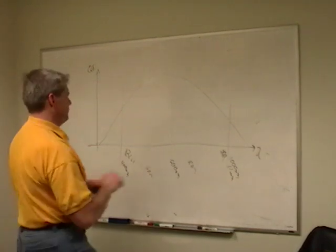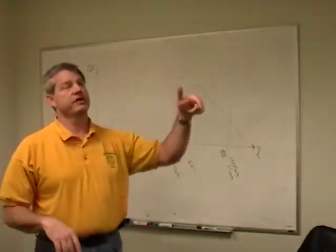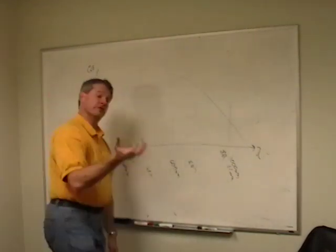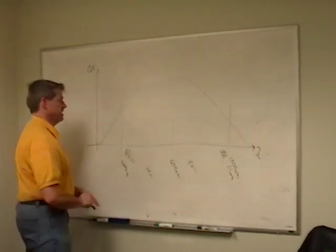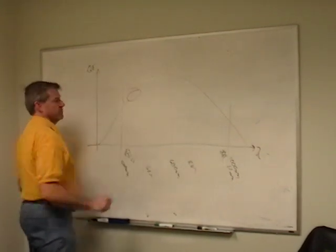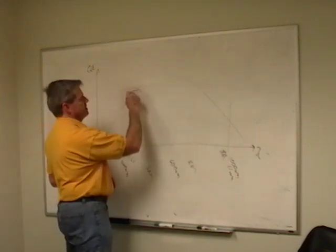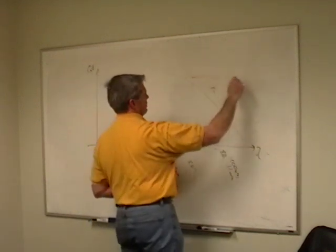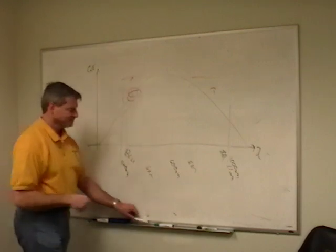And what we do is we put filters up above it, right? A Bayer filter, a green-blue, a red-green, green-blue filter above it, and we can capture the electrons. We know, oh, well, these are in the bandpass of that, they're this color of green. And in the end, if you want to get really fancy, then you could say, well, I can apply this quantum efficiency factor to it and say, if I got this many, then I really got that many. And if I got this many over here, then I really got that many, and back it all off. You can calibrate these things.